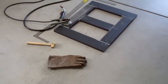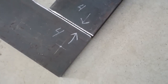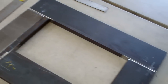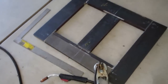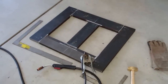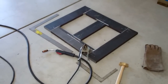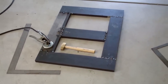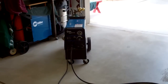I got all the little channels ground into my joints and all the butt ends cleaned up, so I should end up with some nice clean welds. I got the welder set up, got my helmet, and I'm going to start tacking this up — just do a little bit at a time so I don't tweak anything. Just threw a couple quick hot tacks on there with the Miller Matic 185.